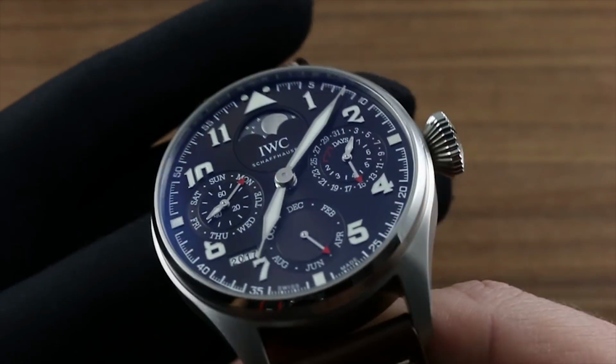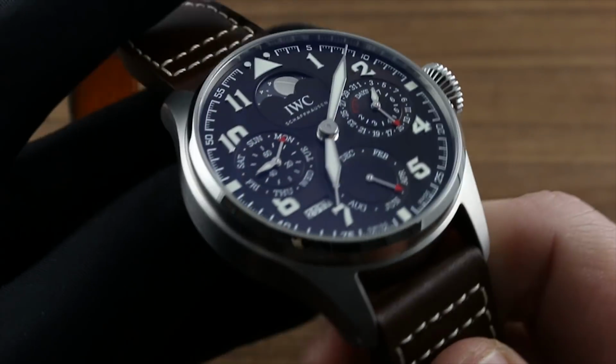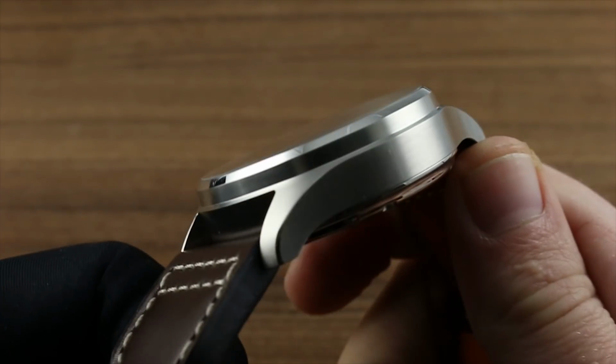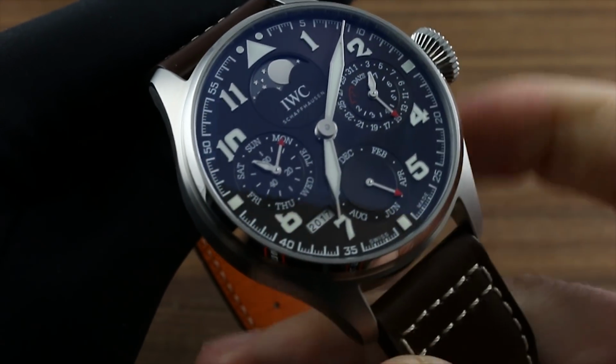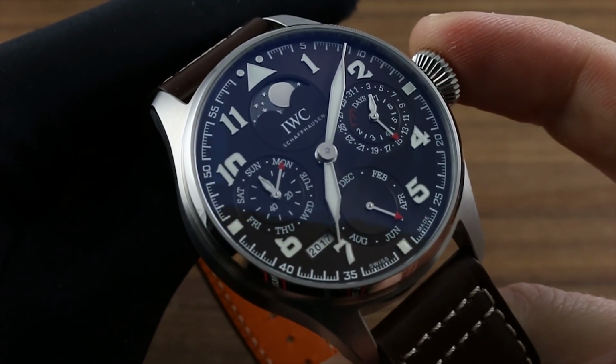Ultimately, a fine mechanical timepiece per IWC requires a comprehensive service every 3 to 5 years. This will include replacement of a worn strap, restoration of factory case finish on the metal, restoration of factory water resistance, as well as cleaning, oiling, and adjustment of the caliber to retain chronometric precision.